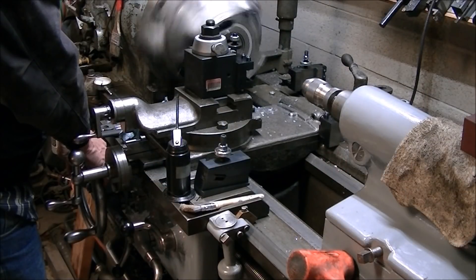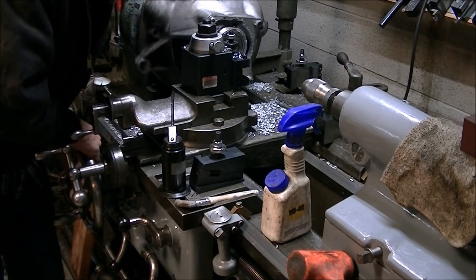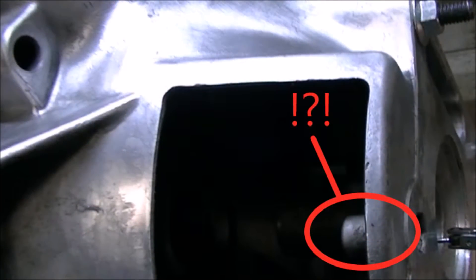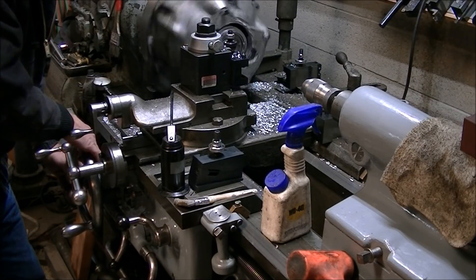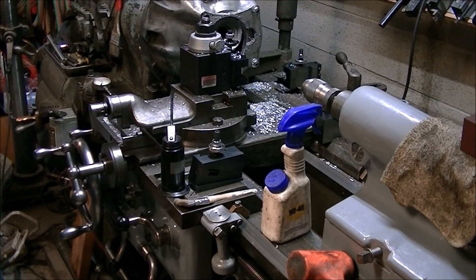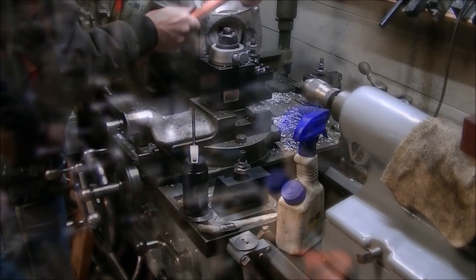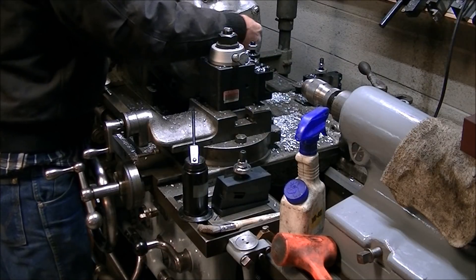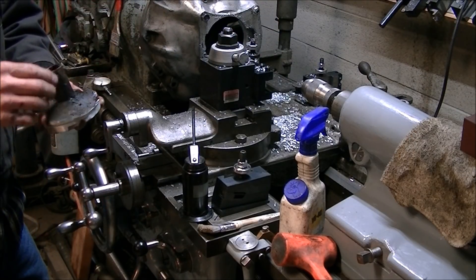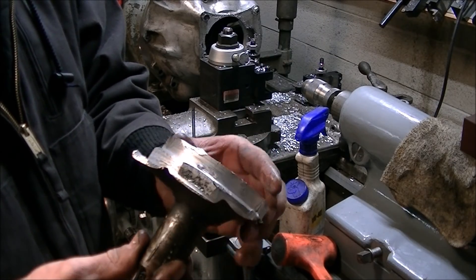I decided I didn't want to spend so much time boring this time, so I would go ahead and trepan it at a much larger diameter. But there were some parts cast into the center — there's a little boss there that's going to give me no end of grief, as the part comes through and everything is cut except that mounting stud. We can watch it once more in slow motion — there it goes, and you see the whole part shift on the faceplate. I was a little bit startled myself.